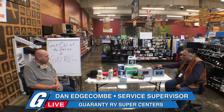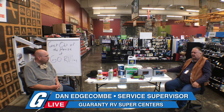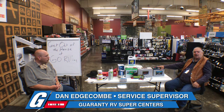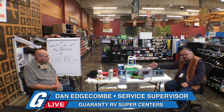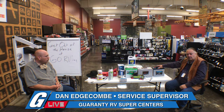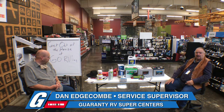AGMs can stand being dead for a few weeks — zero charge — and you can do that a few times where it would kill a regular battery. Their duty cycle is again 600 to 800 cycles, two to three times that of a flooded cell 6-volt. They don't need to be ventilated the way a flooded cell does, so installation can be a lot simpler.